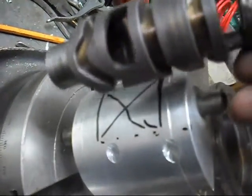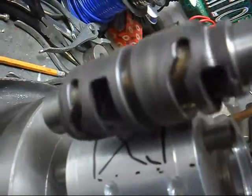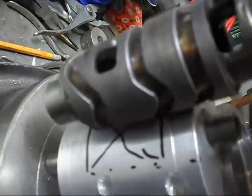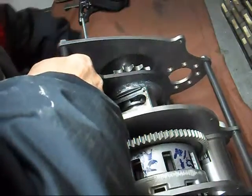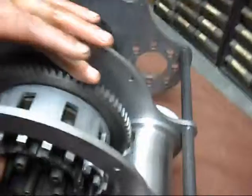We'll come back and do some more there. We're going to modify this shifter drum here to fit in — as it rotates it's going to drive it in gear and out. Here we've got one piece welded in already and we're checking things before we make our final welds on the input shaft housing. Everything looks good so we're going to weld this up and continue on.